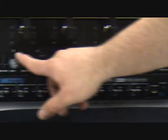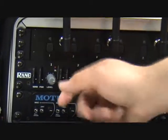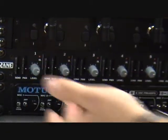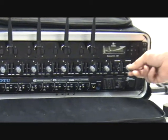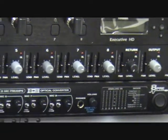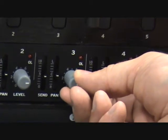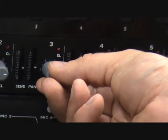On the mixer, the volume button below each place on the Revo Labs Executive HD controls the volume of each channel. All of the volume buttons here are set to level 8. If you wanted to increase the volume on every microphone, you would go to the side and turn this button — that will increase every microphone. If one particular person, maybe on channel 3, happened to be speaking at a much lower level, you could increase just their channel. For consistency, you would probably want to keep these all at level 8.